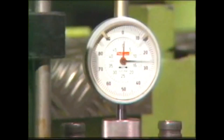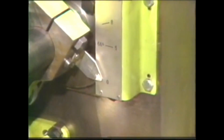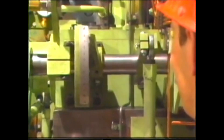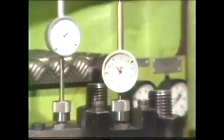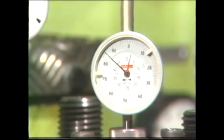The engine is now turned ahead till the gauge above the plunger shows the amount of the idle stroke A. At the same time, the dial gauge above the suction valve must show 0.02 mm. At the first cut-out check, it must be ascertained how much the spill valve opens when the suction valve is just closing and the fuel lever is set to 0. While the pointer on the adjusting plate is at 0, check whether the load indicator on the engine is also at 0. This amount can be read off on the dial gauge at the spill valve and compared with the value quoted in the acceptance report. It must never be less than 0.8 mm.